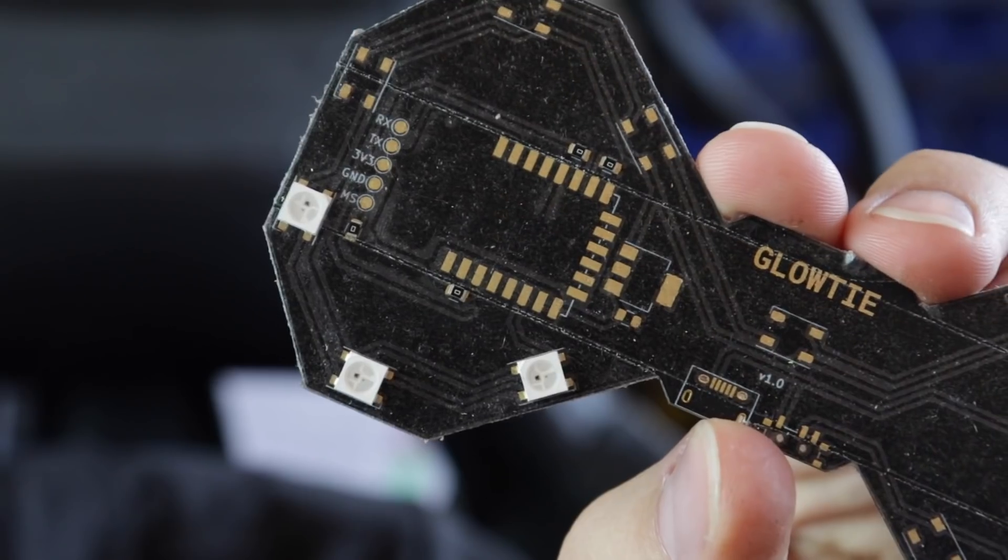It works! My excitement is only outweighed by my relief. Tuning the bottom vision pipeline was way more laborious than the other two steps — trying to get the lighting really good and making sure all the different steps in the OpenCV pipeline isolate the part, getting not only the outline of it but the orientation correct as well. That was pretty tricky. But after you use all of OpenPNP's little offset wizards and it knows where everything is on the machine, you can get some really, really good placement. All the 0805s are just dead on. And so are the WS2812s. I only ended up placing three of the NeoPixels because my passive feeder isn't able to pick them out for some reason, and my NeoPixel feeder is in pieces. But it gets the point across — the vision pipeline works and it's placing them so well. It goes to show that if your relative positioning is really good and you can use vision to calibrate, even with a $400 machine you can get accurate placements.